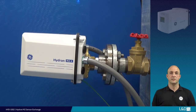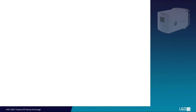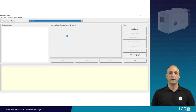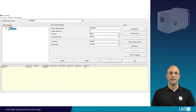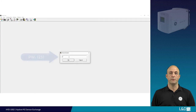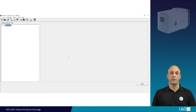Next, re-energize the device when safe. Reconnect with the device via the operating software to enter the new sensor operating parameters. Note: it is possible to enter these parameters with a Hygion HMI, but this can take a long time to scroll through the numbers. To update the sensor parameters, you will need to enter the Level 2 password, which is currently 1231.